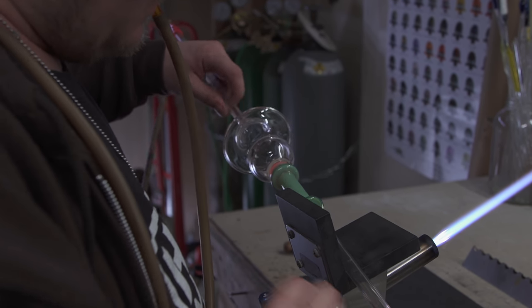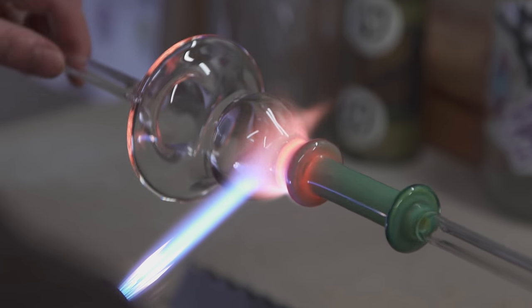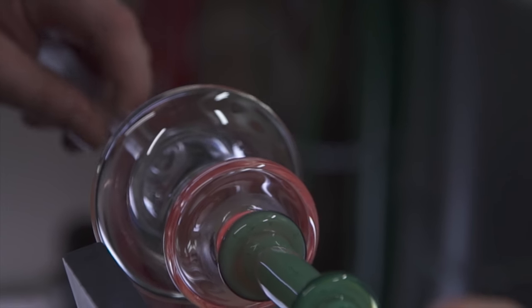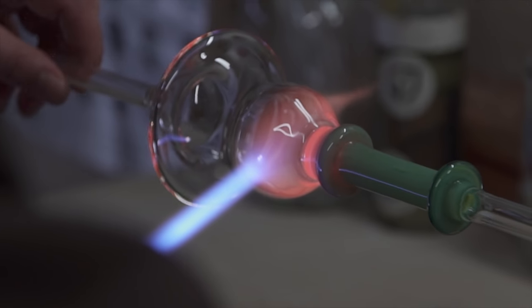As long as your prep is nice and straight and you're really good at your hand rotations, you can sit there almost all day and work on that weld. If your prep's good the first time, it should go right. And we're focusing our heat on that shoulder there so we can push and drop it down.